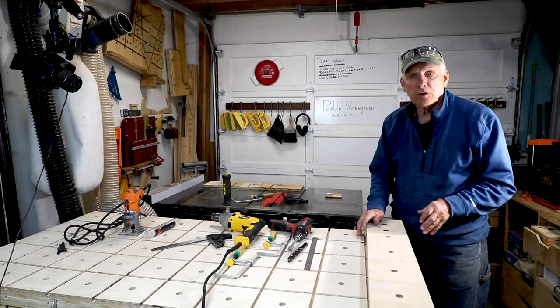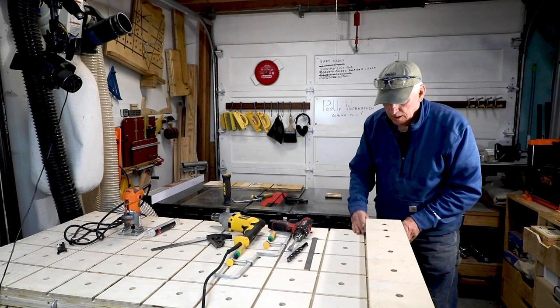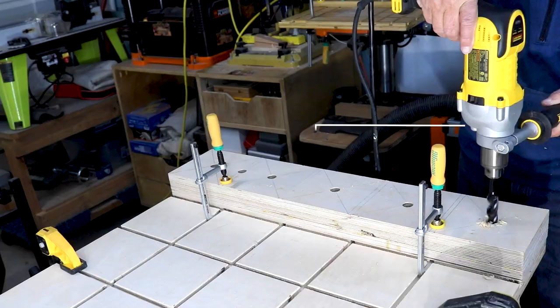So mark that down below, put this over it, look for that crosshatch down below, get it all lined up perfectly, make sure it's flush here and flush this way. And as long as you're very careful going all the way down, you should be able to get some really nice, very straight dog holes.